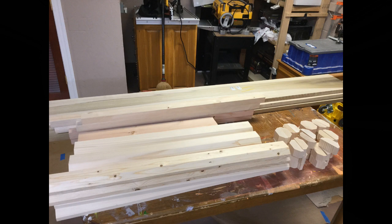After you've done all that, you might run it through a planer or jointer to square things up before or possibly after doing all this. Sometimes when you rip a board down the center, it has internal pressures that aren't released until you cut it and it ends up bowing on you. Having a jointer is a handy thing to help you get out of those circumstances. But we're talking about cheap construction two-by-fours — I think you can also get by buying a couple extra sticks and rolling the dice. Typically only a small percentage of boards are going to do that on you.